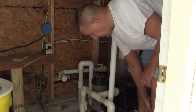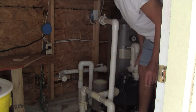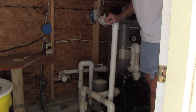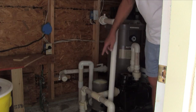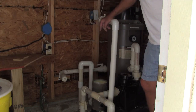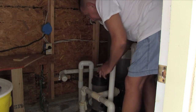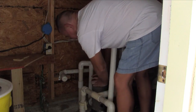Now while I'm at it with the water off, I'm going to check the chlorine. I need to add some. When you open the chlorinator up, it's a good idea to hold your breath — these chlorine fumes are strong, same with opening any pail of chlorine. I've got my inline chlorinator full of sticks. The best setting on the dial: after everything's balanced, one and a half to two works out well. Also, lubricate the edge of the chlorinator with a little bit of Vaseline from time to time so you won't ruin your o-ring.